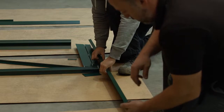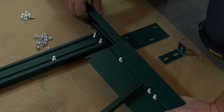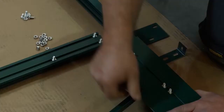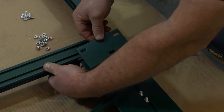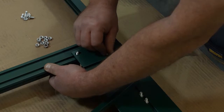Moving now to the bottom of the greenhouse, engage the bottom sill with the two built-in base sections by pushing the angle of the sill under the locator as shown. The door end glazing bar has two bolt channels. Slide two bolts into the channel closest to the corner bar at the bottom of each glazing bar, one bolt into the channel closest to the middle of the assembly, and three bolts into the bolt channel of the built-in base. If fitting on soft standing, you need only one bolt in the base channel. If installing onto hard standing, attach an angle bracket to the middle bolt of the base. Attach the bottom bolts in the glazing bar to the bottom sill, but don't put the nut on yet. Attach the rectangular plate to the two bolts in the glazing bar and the closest bolt in the built-in base. Ensure that the glazing bar is right down to the sill. Attach the diagonal angle to the top bolt in the rectangular plate, then put the nuts on.